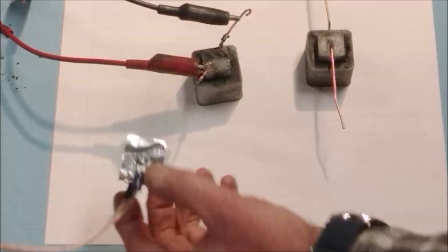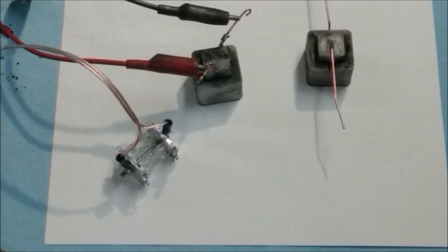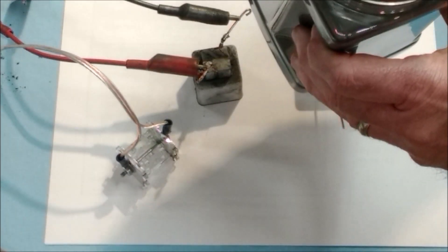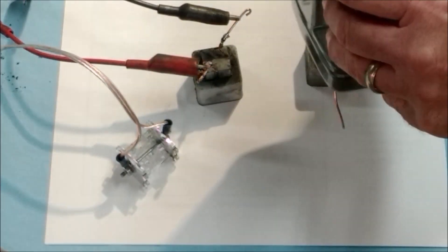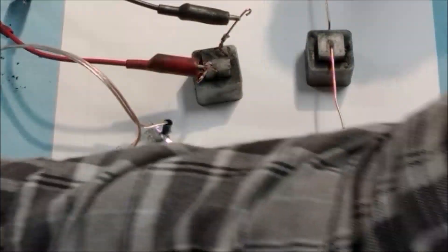This is the classic square resistance probe we use to measure the surface resistivity of conductive inks or paints. But if I'm trying to measure just the graphite powders, sticking a couple of probes in there isn't very repeatable or consistent for telling me how good the raw material is. So we came up with a couple of different test fixtures.